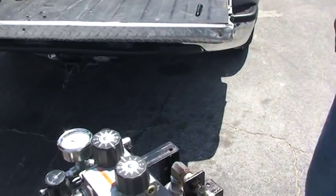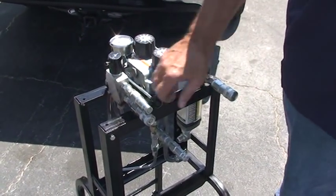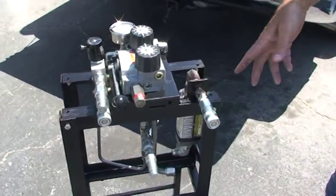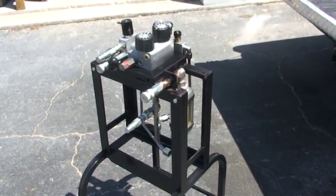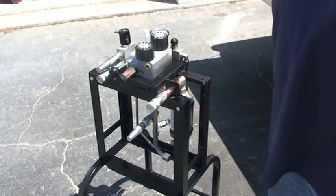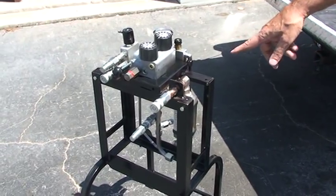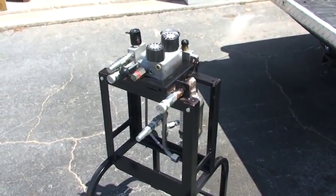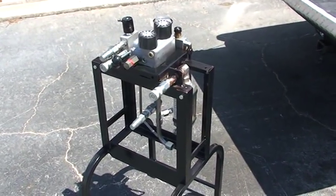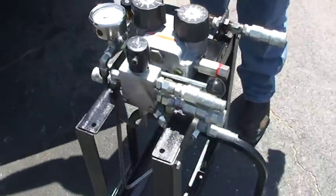That is a pressure relief valve — internal pressure relief, preset. It can be moved, but you should be fine because it's in the range we're talking about. If they put in a big power pack with 25 gallons coming in, you can go up to 25 gallons — putting 25 towards the drive wheel and two or three towards the tensioner. If you only need eight or ten, you would either idle the engine down to get reduced output or use a dial-in setting to take it from 25 down to 12 on the power pack, so you can get five, eight, or ten gallons a minute on these packs.